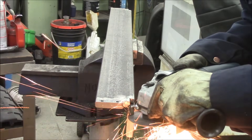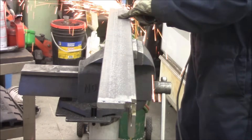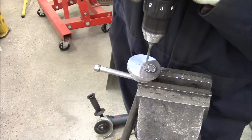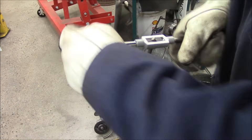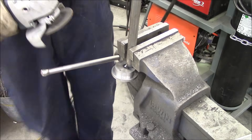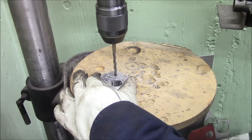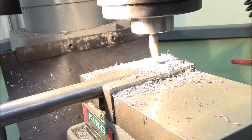I'm cutting a slot out of the base again — to get the shape I wanted I'd need this on end and my 6x26 mill can't do it. This part's kind of cool: we're drilling a hole through the circumference of the bolts, then I can thread it and a bolt goes through there to lock them together. It can still be disassembled. Then the handles become part of the bolts to hold the whole thing together, so you can still take it apart, but it is assembled and fixed.